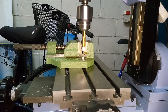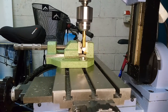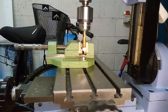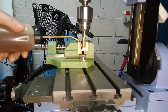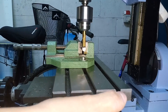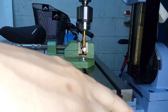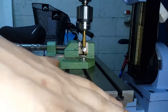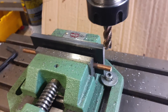And finally, the first run on the mill. I know this chuck is not suitable for milling, but I only have this at the time of the video, so I was impatient to start milling. I fit an 8mm end mill on the drilling chuck and want to try the machine as soon as possible. Now I'm trying to cut this little round piece taken from an old printer — it's an old printer axis. It seems to be very hard steel, but the mill cuts very well. I am still trying techniques and tools with this machine, so I expect more videos about this.